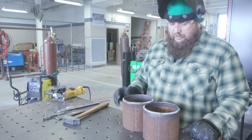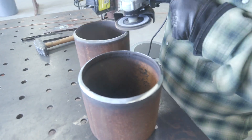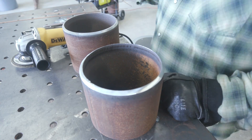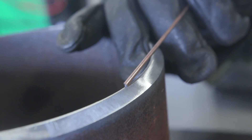I just got done cleaning these up — they're not bad. I'm going to take down the root face, make it about 3/32. I'm going to use this wire as a little reference point and go around, try to make these things exactly the same or as close as I can. All right, I got the first one done — I'm going to knock out this one real quick.